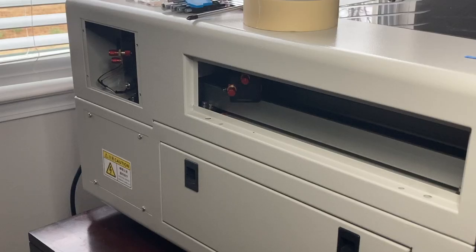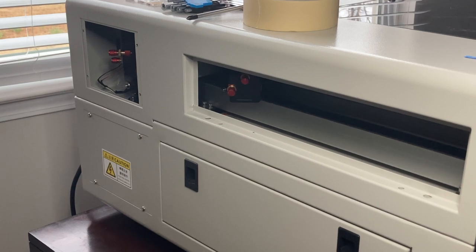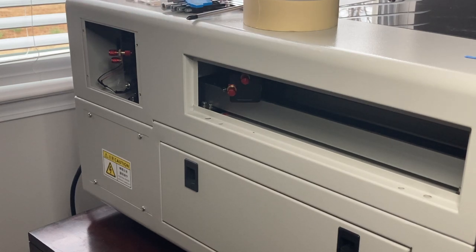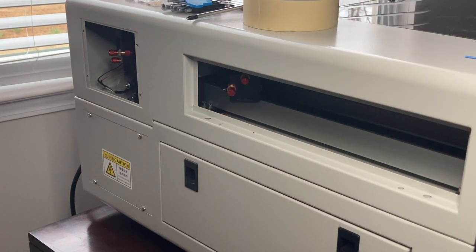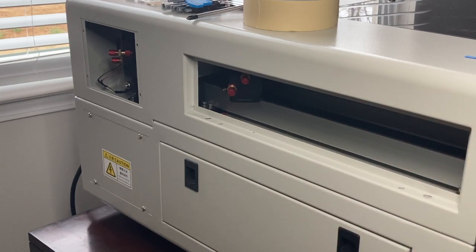Standing in front of your machine, you'll be working on the left side. At the very top there are two panels. The first panel in the far back is where mirror one is located — that's the side entry for adjustment. The second panel is where mirror two is located. Take your screwdriver and remove all four screws from the second panel, then remove the first panel by pressing on the two spring-loaded black clips simultaneously and lifting it up and out.